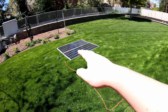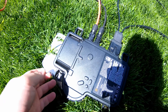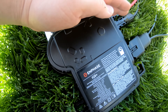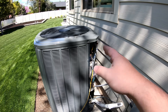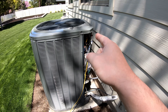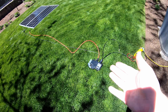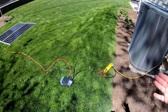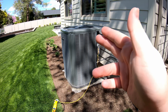So here's what we're going to test today. I've got 400 watts of solar for testing. Those come over here and I've got this excess Enphase solar inverter — the Enphase IQ8 Plus microinverter — feeding into the air conditioner. The thought is: can I use the contactor on the air conditioner to vary when this inverter sees grid power, so that when the air conditioner turns on, this in turn sees the grid and starts generating power from solar, offsetting the load — but not running any risk of back feeding to the grid.